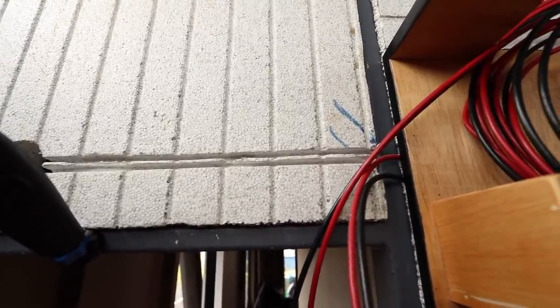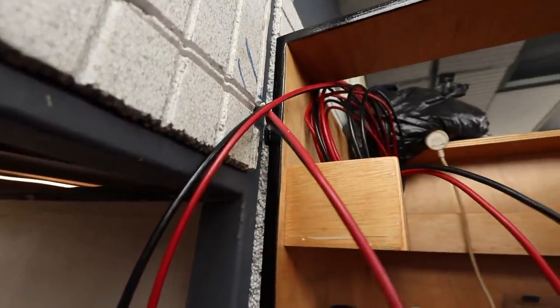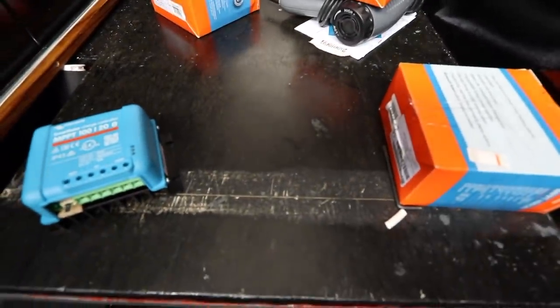And then at the moment you might remember from the previous solar episode, this 8mm thick cabling used to sit inside here. That's all going. We're running four individual runs and we'll have conduit around the whole lot. So it's a bit hard to show you, but it squeezes down beside the YouTube box of wonder that Tim built and works its way down underneath these floorboards in the wheelhouse to where the charge controllers sit.